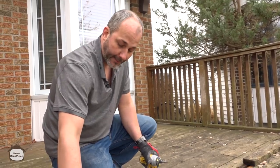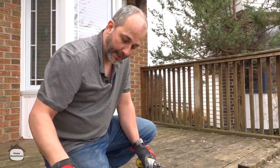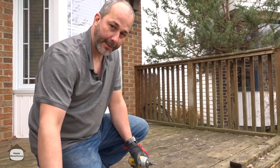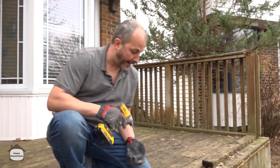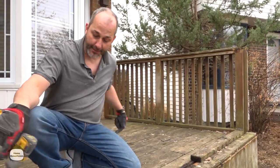Because of that situation, the top of all these joists are going to be compromised. So when we put our new decking lumber down, we're actually going to have to go back with a three-inch screw so that we're going past the compromised lumber into solid meat again. That'll solve the problem and enable you to save all of the substructure.